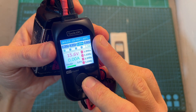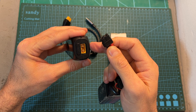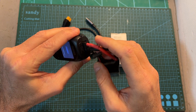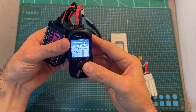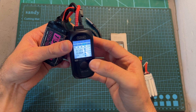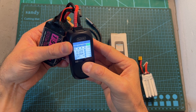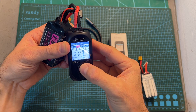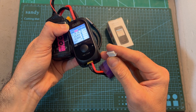On its right side you can find a balance plug, on both sides ventilation holes, and on its back side a fan which only starts working when needed. Using the charger is extremely simple. After connecting a power supply, battery, or quick charger, the charger powers up. You then unlock it by short pressing the button, select the output current by short pressing it, and select the end voltage per cell by long pressing it. The output current can be set to 1, 2, 3, or 5 amperes.